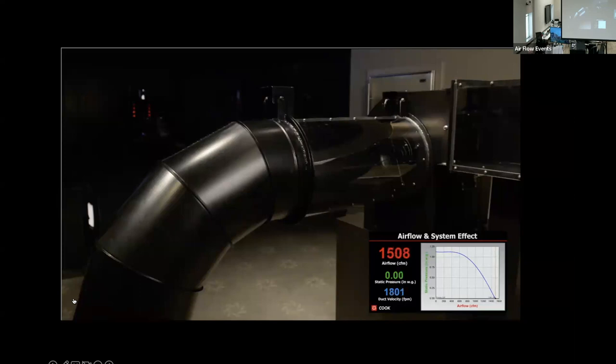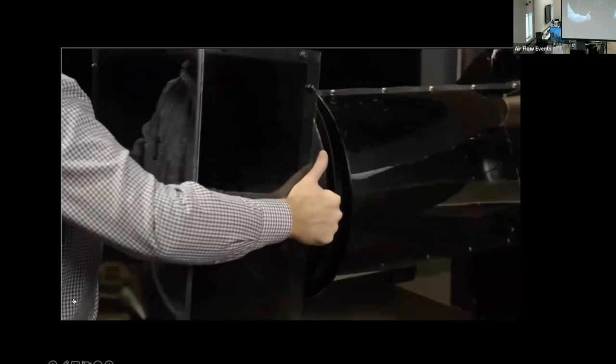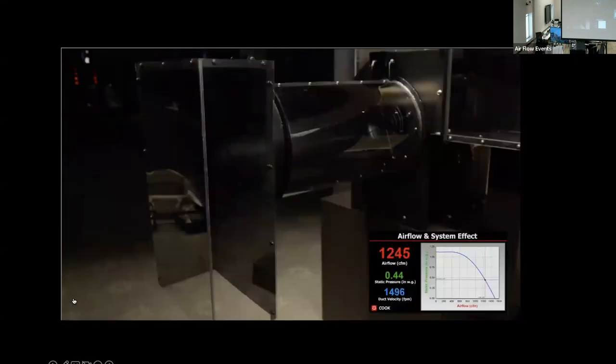Instead, you may see another type of fitting called a box and tap fitting. After replacing the long radius elbow with this fitting, we see the pressure loss is about 1/10 of an inch water gauge. Not bad at this low velocity.